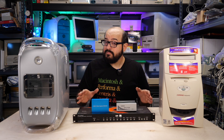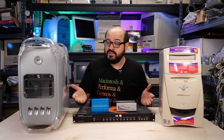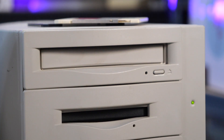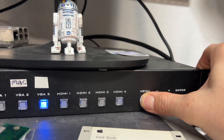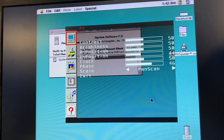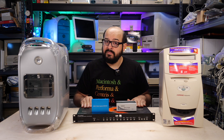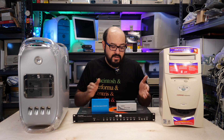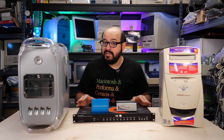Once you have all the hardware and wires plugged in, all you have to worry about is the software. A lot of these USB capture devices are compatible with Macs and PCs and software like OBS or QuickTime Player, but you will need to do your research to make sure they are compatible with your system. Some devices made by other companies may only work with proprietary software. Some video scalers have advanced menu systems to adjust the phase, output, and horizontal and vertical positioning of the VGA signal and how it's converted to HDMI. Some will do all of that automatically. While you're looking at video scalers, do your research — look up the manual by the model number to get an understanding of the resolutions it supports and the features the product has.